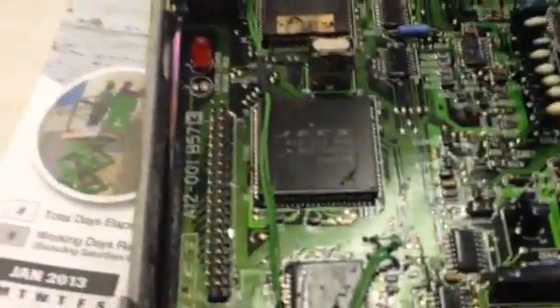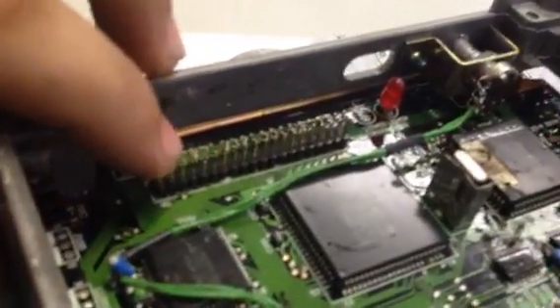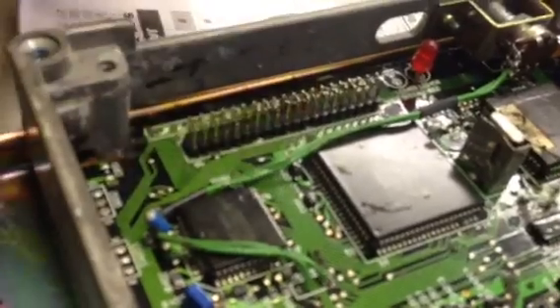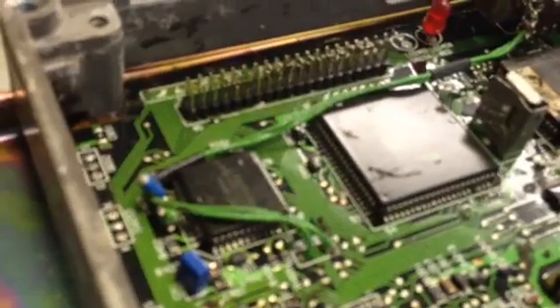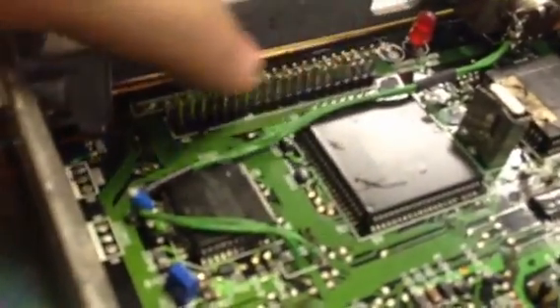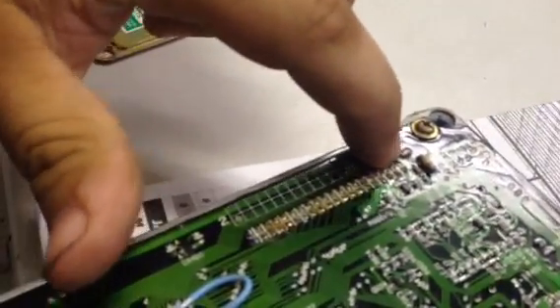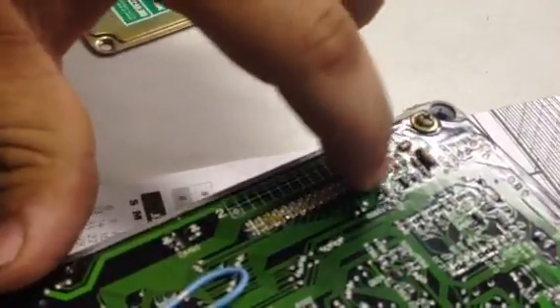When you get it desoldered, you'll have all these holes empty — completely empty. You'll put the pin board short ends first. If you look at the pin board when you get it, these pins are kind of tall on one side. The other side is shorter — the shorter side goes down first because this is where the daughter board slides onto. If you don't have the tall side up, it's not going to work and you'll have to desolder and redo it again. Long side up. You pop it through and push it down evenly — make sure it's even because the needles will move a little bit. Once you're down evenly, you individually solder each little piece one by one, every single one all the way to the end, both sides.